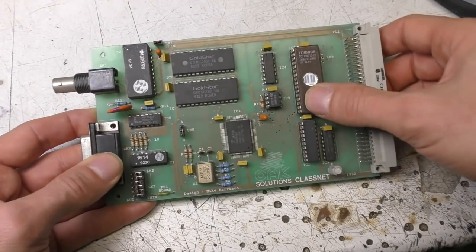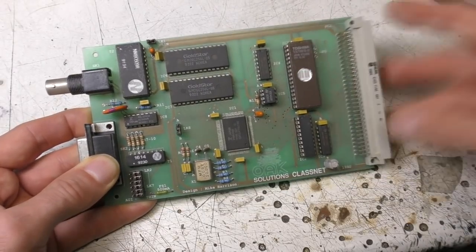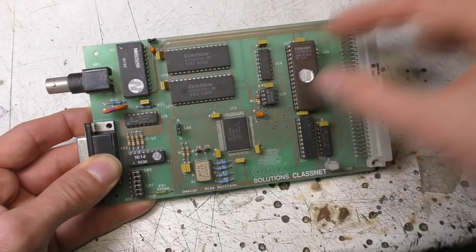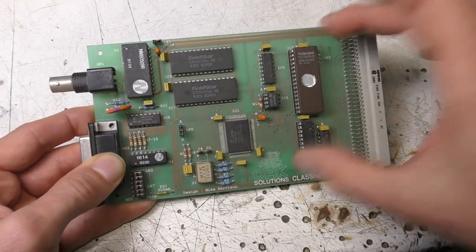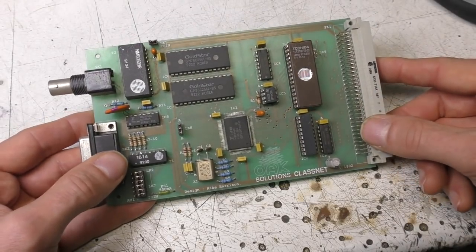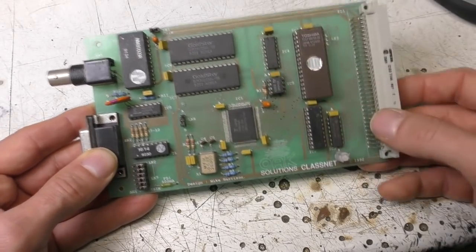There was also some functionality in here to use some non-volatile memory to make a few things non-volatile within the machine. So for example, you could set it to boot up straight as soon as you turn it on, and there were a few other things which I don't remember the exact details of, but there was a little bit of software functionality in there that was very useful in that context. And I think we even did a board which had literally just an EEPROM and the non-volatile memory on it for those applications that were using Ethernet to do some of the same things. Again, I don't remember exactly what, but there were a few things which made quite a difference to the usability in a classroom setting, just having this extra few little bits of software in the ROM and a little bit of non-volatile configuration memory.